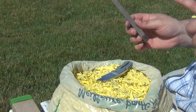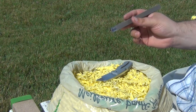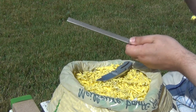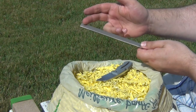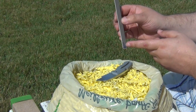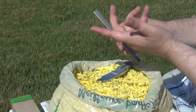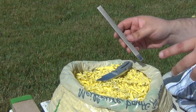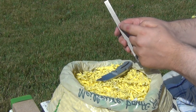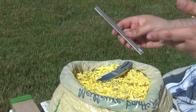As a side note on cubic boron nitride rods — a couple of people wondered what the markings on the bottom mean, since I have numbers written on the rods. Essentially these rods only have abrasive on the top surface; they're not like a stone which is abrasive all the way through. It's just a coating, so when that abrasive wears down, that's it — you're done. So I've marked the edge I'm using, called it number one with an arrow towards the corner I'm using. I only use that one side and that one corner, which allows me to then switch to another corner and side that still has near as-boxed aggression, so I can compare and see how it wears over time.